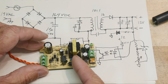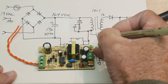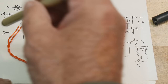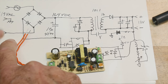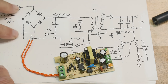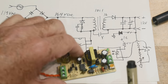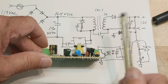And it has to be a high voltage capacitor, and it has to be AC rated. And so they use a Y capacitor. I don't know why they don't use an X capacitor, but they use a Y capacitor. Y capacitors are used to filter the input from RFI situations also. They're generally put on the AC lines to ground. So there'd be a capacitor here to ground and a capacitor here to ground. You'd have these two ACs. That would be a Y capacitor. And then you could also put one across the two ACs directly, and that would be an X capacitor. So yeah, I don't know. Anyway, that's what that one does. I don't really have a good gut feel why it works, but that's why it's in there.